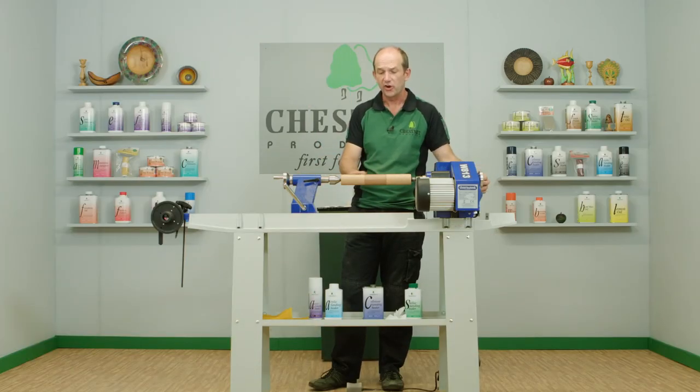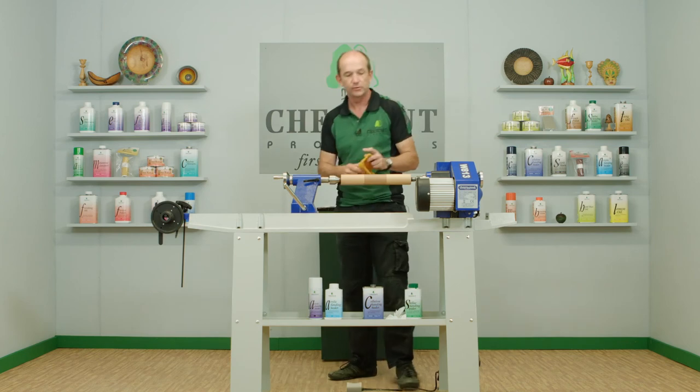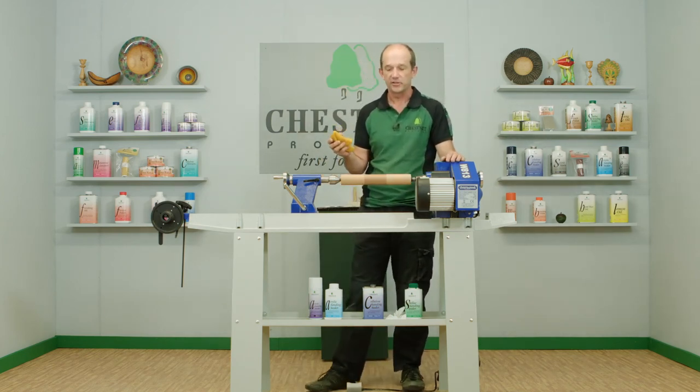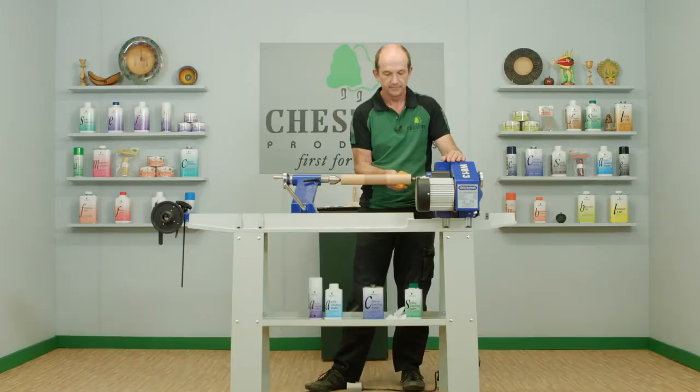So that's the acrylic sanding sealer dry, ready to sand back in preparation for putting the next coat on. In this case we'd probably use the acrylic lacquer in brushing form, but we could put one of the waxes or friction polish over the top quite happily. It's important not to use something like the melamine lacquer because that will attack the acrylic sanding sealer — they're just not compatible. Using the last abrasive we used on the timber, in this case the orange nyweb, just a quick cutback. No real effort involved — it sands very easily.